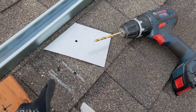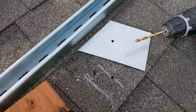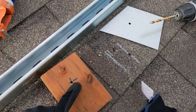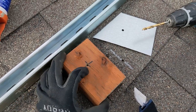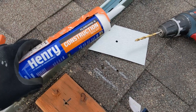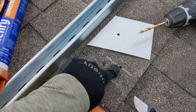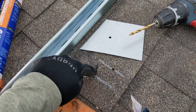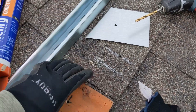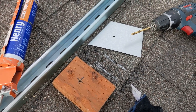I drilled out the hole and measured so it's all the way through. Basically, you take a piece of flashing that you cut with a hole drilled in it, line it up with the hole you drilled — it's about four and a half inches. Then you take some Henry's sealant, plug the pilot hole, put a little in here, put the flashing over, put a rim around it, stick it down, and screw that on top. Let's go ahead and do it.